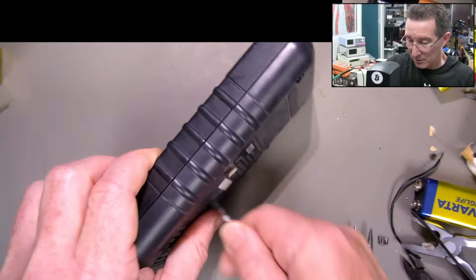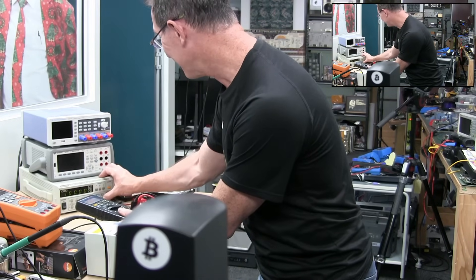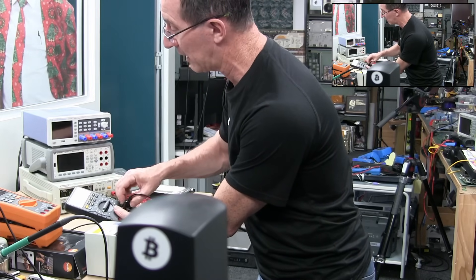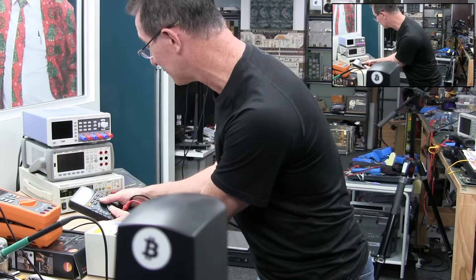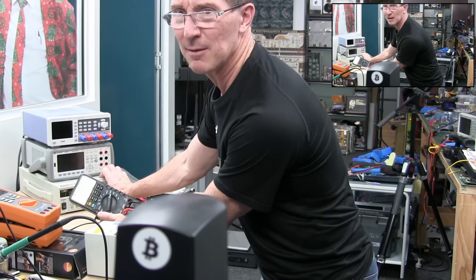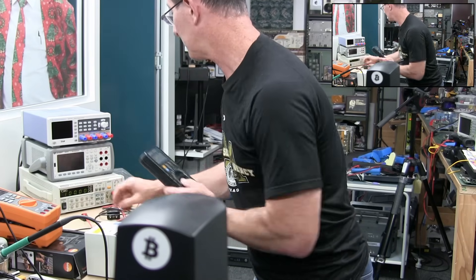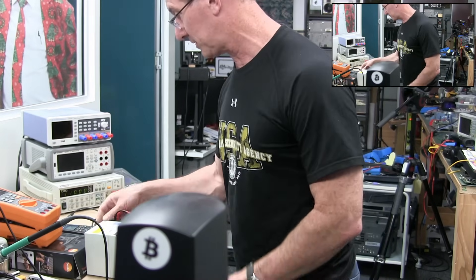We're missing one screw. Let's go to the videotape. 100.03 millivolts, 0.99997 - yep, no worries. 10 volts - no worries. Wiggle, wiggle - not a problem. 1,000 microamps. All the fuses are intact in these meters - the fuses are worth a small fortune. 1 milliamp there, 10 milliamps - yep, all good. 100 milliamps, go to the amps range - gets down to the bottom end. And ohmski: 10k, no worries. A couple of digits high but it's all good.